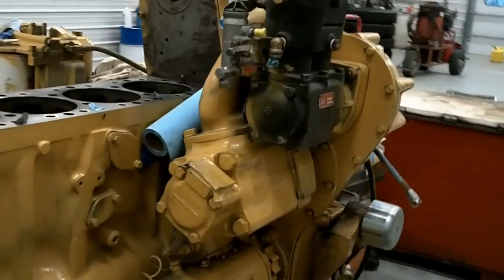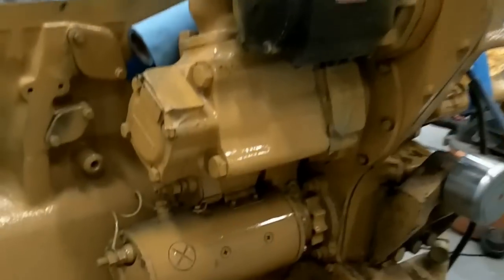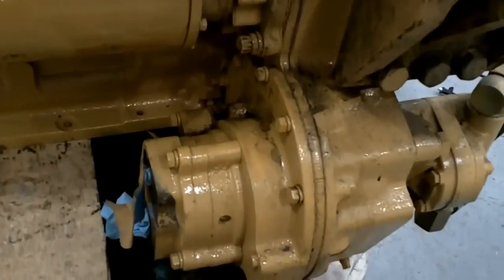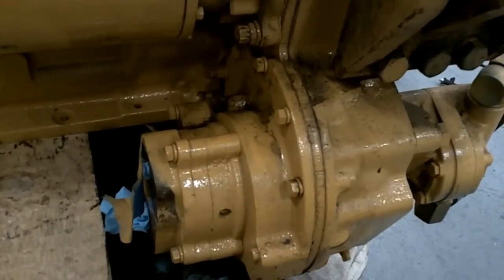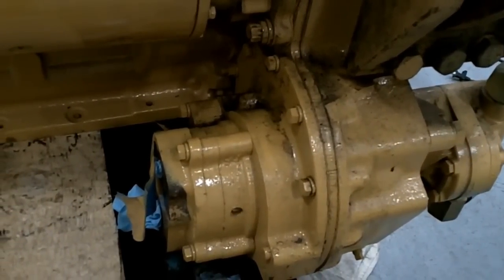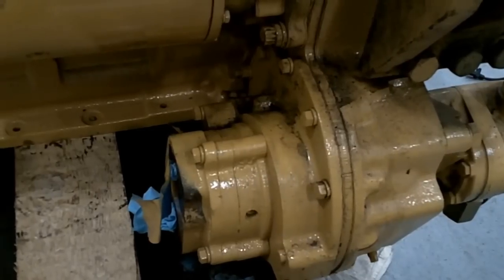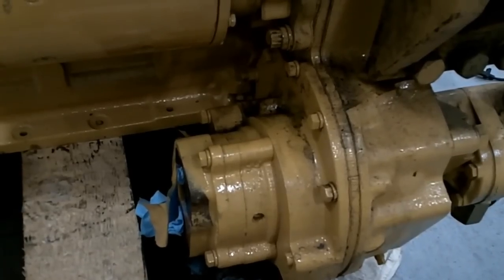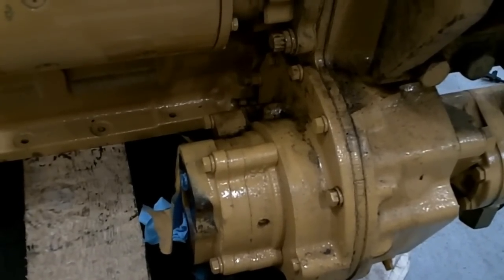If not, you can put shims under the bearing blocks on the cams and raise them back up until you can get your driveshaft in. The drives are always on the rear on these old ones. You've got your starter there, and down there is the scavenge pump — it scavenges all the oil out of the retarder housing on the back, out of the flywheel housing, and runs it up into the driveline bearing on the rear to lubricate it.